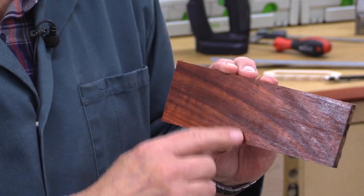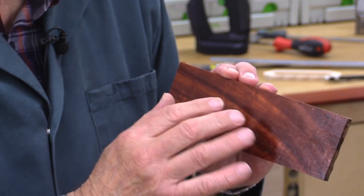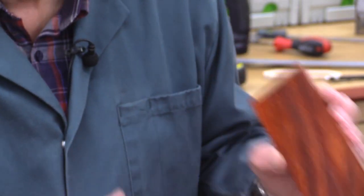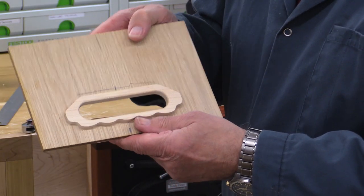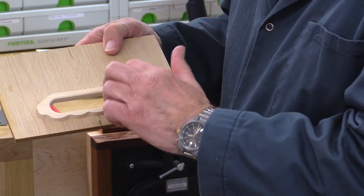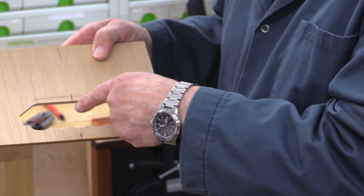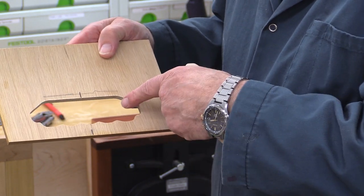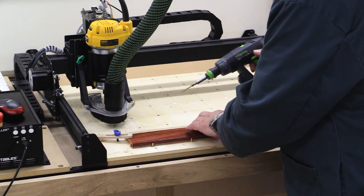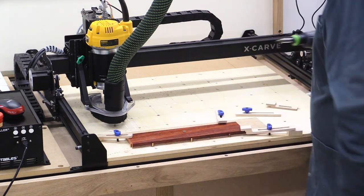So I'll be able to cut out one of these pieces, put my insert in, glue it, and once that's dry, sand it off without any glue having penetrated the wood. This is my test piece and I've just put the insert in to make sure it's about right. I need to make sure that when I cut out this hole here, the piece that's left behind doesn't fly off everywhere. I could use double-sided tape, but this time I'm going to put a screw right in the middle here so I can screw this piece safely in place. That's holding it nicely.